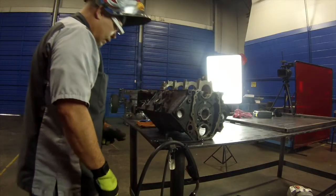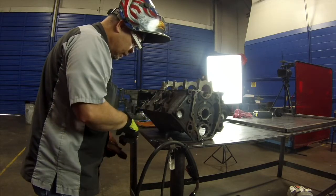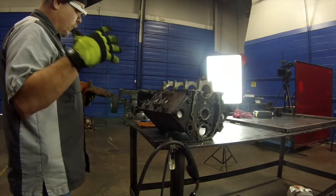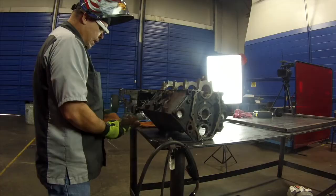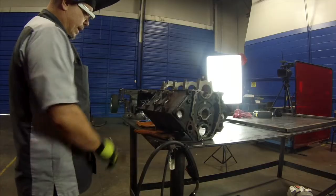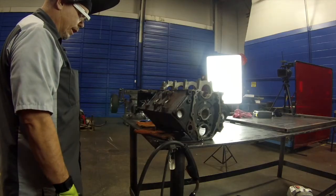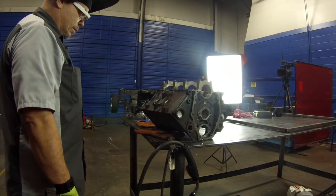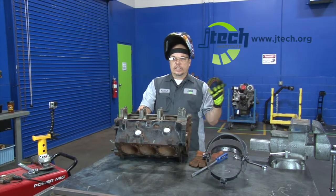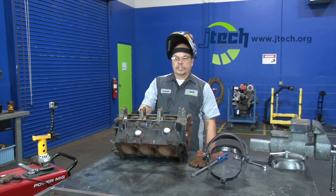Look at there — you can see how clean that came out. No problems. Let's get a look at the threads inside the block — they look to be really nice and clean as well. So it looks like we've got that broken bolt out, and all we did was use a welder to weld a nut and washer to the bolt. Remember, doing that shrunk the bolt and allowed it to break loose from the surface it was in. We never had to heat up that cast iron, because if you heat up cast iron, it can easily crack on you. This technique works really well on an engine block and very well on an exhaust manifold as well. Thank you for watching, and hope to see you again soon.